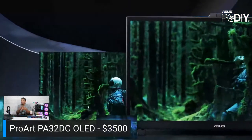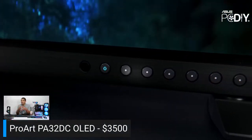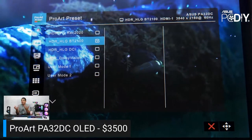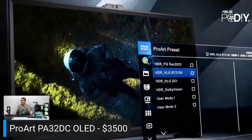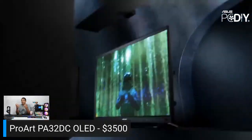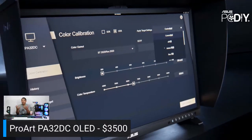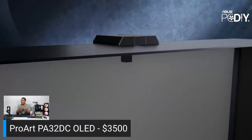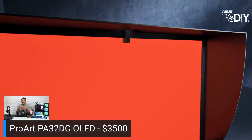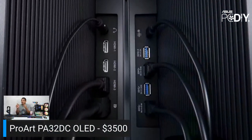I'll talk a little bit about what the difference there is, because traditionally most of the OLED panels on the market, and even many of the ones that we've used in our other OLED enabled products, have been WOLED, which means that there's a white subpixel present, but that influences certain aspects of color rendering performance. So there is going to be a difference here, and this allows us to achieve an even higher degree of color accuracy.